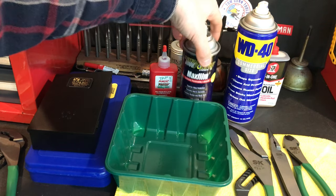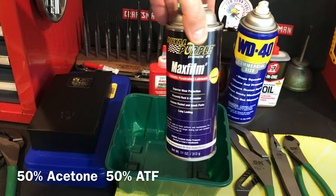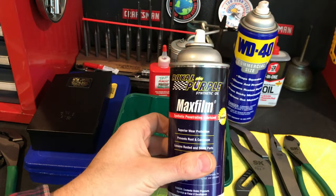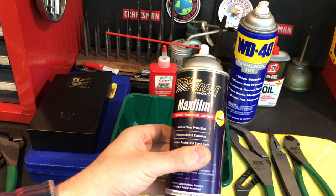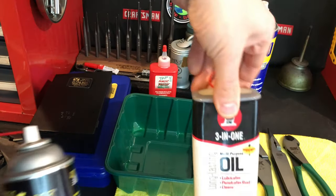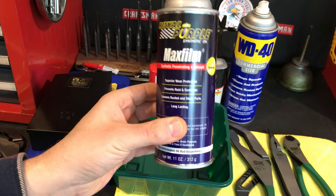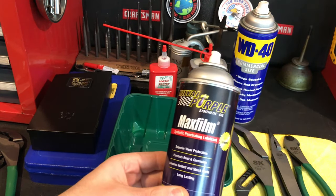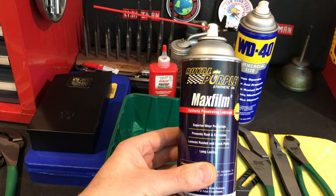So like I said, this was new to me. If you know about this product or have used it, please share in the comments below. It's not going to replace my 50-50 — there's always a place for that — and it's not going to replace my tap magic. But if you only had one thing, it actually would be the most universal thing to have around in your shop. Sometimes you just need to shoot something real quick for the tip of a drill bit — you have it. You need a quick lubricant — it's there. You need to bust something free — it's there. I really love 3-in-1 oil as a lubricant, but sometimes it's not handy, and if you have this there, just a quick shot of this. I'm going to really use it a lot for rust prevention, and you only need a little dab, so I think it can last a long time even though it seems pricey. Tools are expensive, and if you could prevent them from rusting, you're ahead of the game — you're actually saving money.